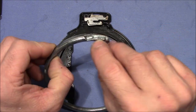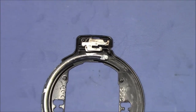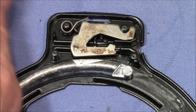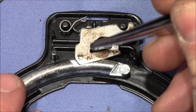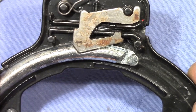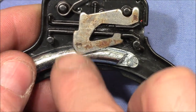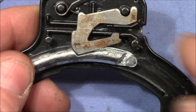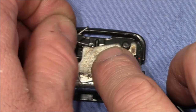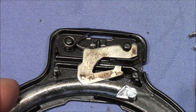The locking mechanism holds it in place at this position. We have this cutout here — let me zoom in for a close-up. There is this lower plate with this shape to go into the cutout here, and so you can see the bolt cannot retract because of this edge here filling the cutout, and so it's blocked. There is also this spring, which pushes down on this plate.